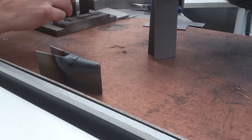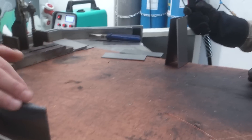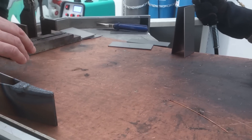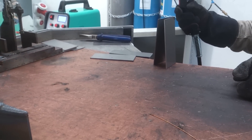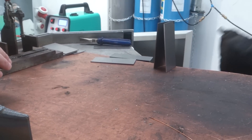You'll see here, and you'll all be able to have a go as well. Very, very easy to use. The secret is the re-ignition after the short circuit is broken. The software, the hardware within the machine, reduces the amount of current and reduces the voltage time at the point of re-ignition. It makes it all very, very controlled, very, very easy to use.